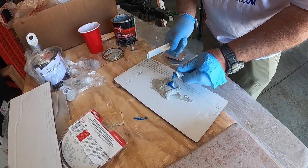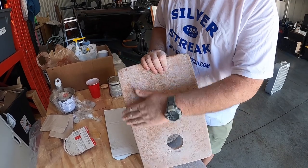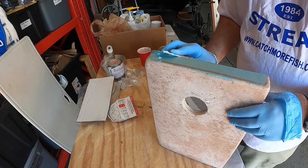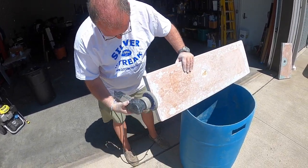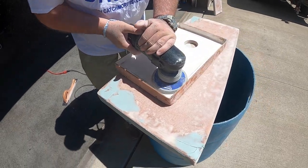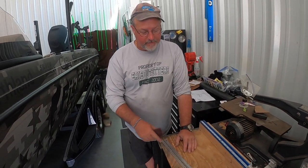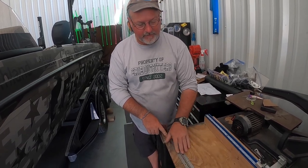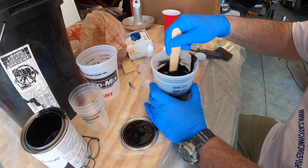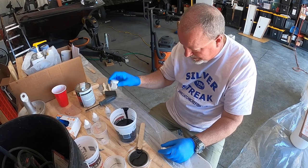What we're going to do now is mix up a little bit of Bondo — just any kind of filler agent — because we've got some inconsistencies. It's a little wobbly; we're going to straighten this up a little bit and fill in the edges around here, because there was carpet on here before so we didn't need it to look nice. Now we're going to have a little edge around it with EVA foam, so we want that nice and smooth and then we'll gel coat it — slick as a whistle. We're going to rough sand this with 60–80 grit to get the big stuff down, then go back and finish sand it with 150 before we gel coat it. Before we install the hatches again with the hinges, we're going to clean them up — hit them with a Scotch-Brite pad and shine them right up. Then we're mixing up the gel coat, putting the catalyst in going off our mix chart, and adding a waxing agent to help it set up.